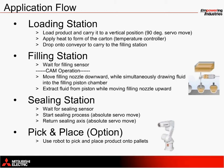The application flow starts with a loading station, where flat, compressed containers are individually transferred mechanically onto a rotating arm. The product gets expanded to take on its full shape while being transferred 90 degrees to its vertical position. At this point, heat and/or glue is applied to seal the bottom of the container. A temperature controller is used to maintain a constant temperature in order to heat-form each of the containers. The product is rotated another 90 degrees in preparation to be placed onto the conveyor. Finally, once the product reaches its bottom location, it's dropped onto the conveyor to be transferred to the filling station.